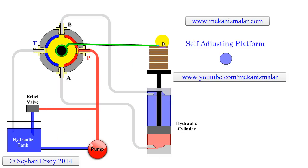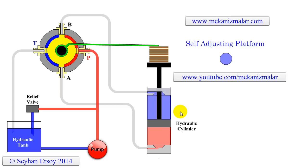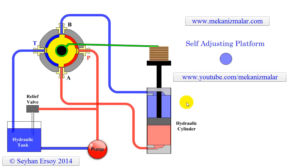When the operator pushes the workpiece toward the working platform, behind the self-adjusting platform, the green arm falls on the next workpiece on the stack. This allows the stack to rise toward the equilibrium position. Each time the operator pushes a piece, the same process is repeated as long as there is a piece on the stack.